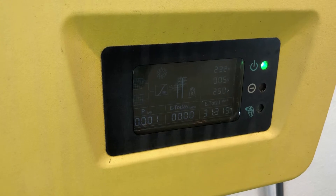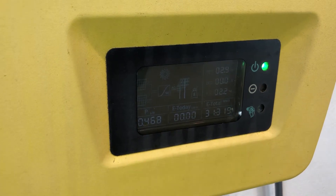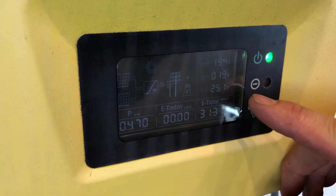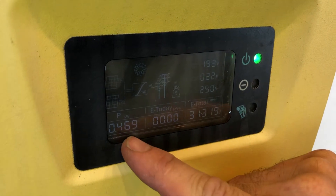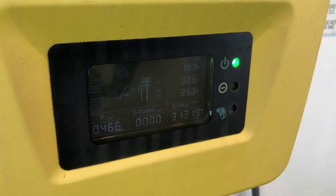Just had a relay pull in there — okay, the green light's gone on constant and it's actually producing power now. So that reboot has actually sorted out the issue. You can see the DC amps is 2.9 amps and we're actually producing some power now, which we weren't doing before. So a reboot of the system in this case has rectified the issue.